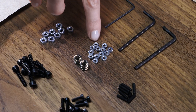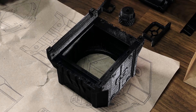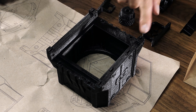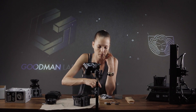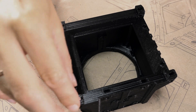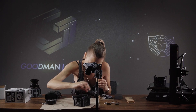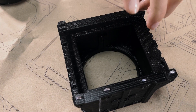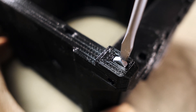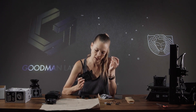The first step is inserting the nuts — these small M3 ones — into the raw camera itself. We have 13 of these. You're gonna find six holes on the back of the camera, and seven on the inside which I'll show you later. We're gonna put these little M3s into position with the pointy side down and place all six into position. Some may fall further in and some may just stay on the top, but we're gonna fix those using a regular screwdriver. They may wiggle a little but don't worry — once you put the screws inside they're gonna be kept in position.